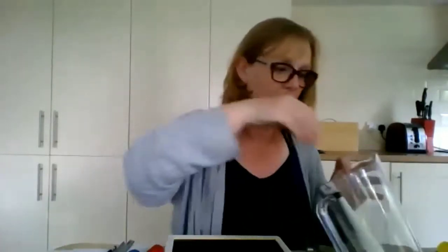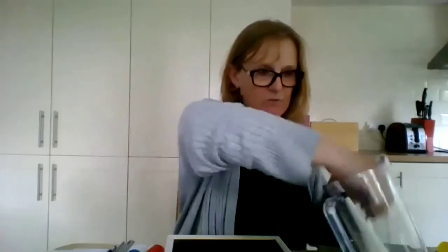I painted the frames and my piece of wood, and then I got my drill out. I'm just going to get rid of those bits over there. So this is when the DIY comes in, because you'll need a pencil and a ruler, because you need to make sure that your shelf lines up properly and you've got some decent thick screws. So the tools I used, well, I had a bradawl, a Phillips screwdriver. I did actually have an electric drill as well, and I used two 1.5-inch screws. I went 1.5 inch because I wanted them to go in quite a long way to support the weight of the shelf.